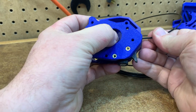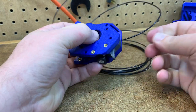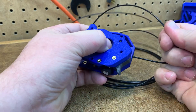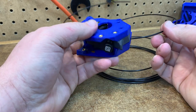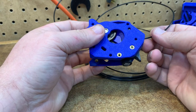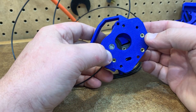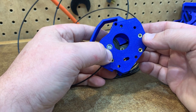It's still slipping a little bit, still a little bit loose, so I'm going to give it one more full turn. But right there, I can pull it out, but it's still in there pretty darn good. So that's about where I adjust it. That's just a quick overview of how to adjust that anti-squish thingamabobber, and then how to adjust filament tension when you're putting together a new stealthburner.